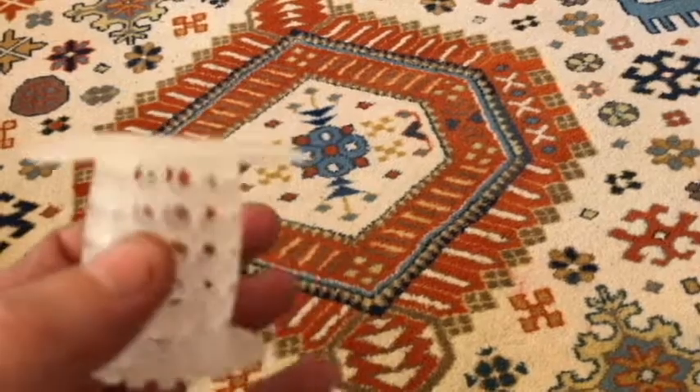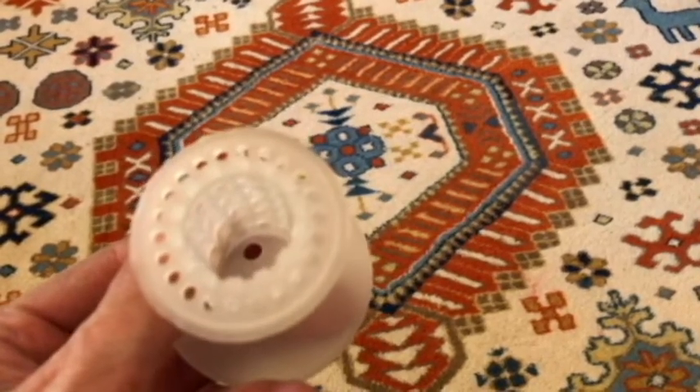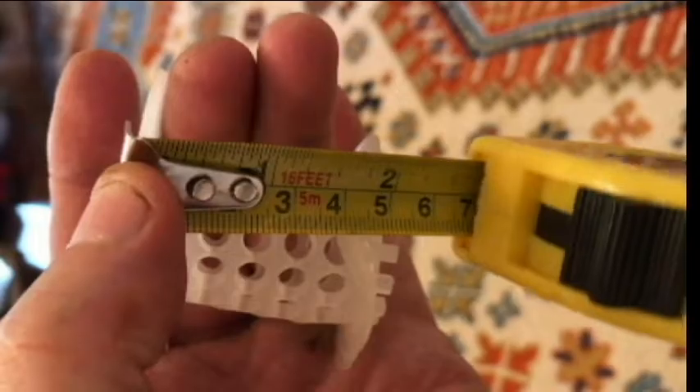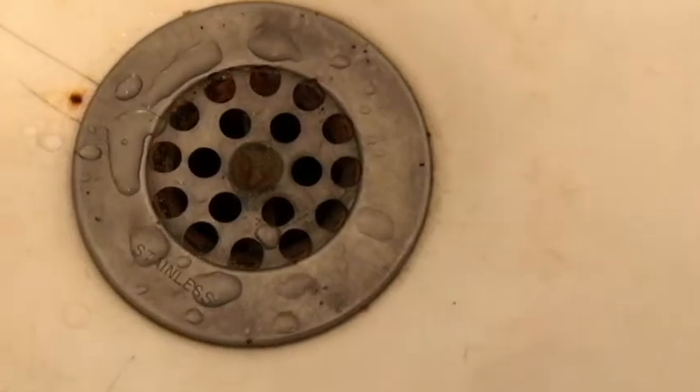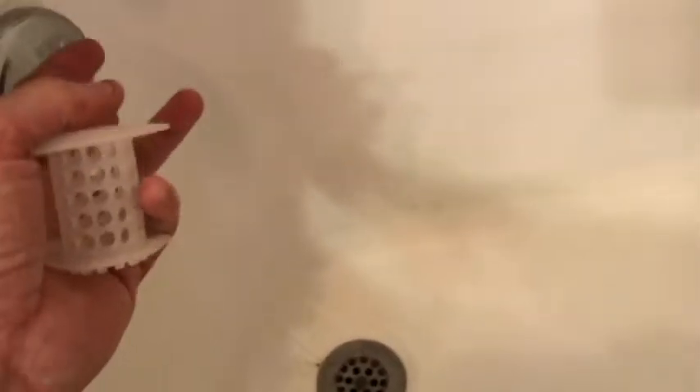That's what it looks like. It's supposed to stick out about a half an inch. I've got a measuring tape here — let's measure it real quick. I'm getting around one and three quarters of an inch, and it is approximately two inches tall. So in the bathtub, you have a cover with a screw holding it in place. You take that off and then you should be able to put the TubShroom in its place, leaving it about a half inch up. I'm pretty sure you'll still be able to use your basic stopper there.